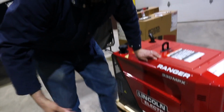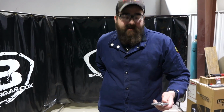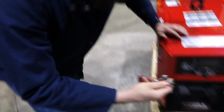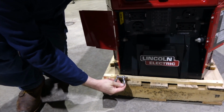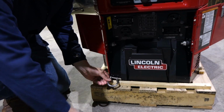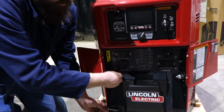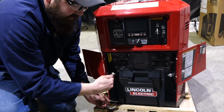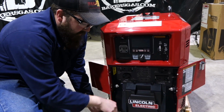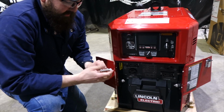One thing that I misspoke about earlier is these lifting lugs. Now, I was lying when I told you they were lifting lugs. They're not lifting lugs. What they are is they connect to the front of the unit down here, and they are actually cable lugs. So you string your cable up through that and put it into your lug connector or straight right on there. And what it does is it keeps tension off your lug when you jerk on those cables. So it comes down through here and it pulls on this instead of pulling on this. Pretty unique to that unit.